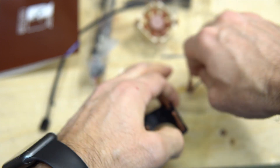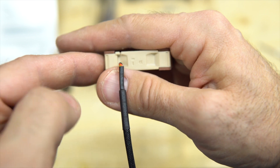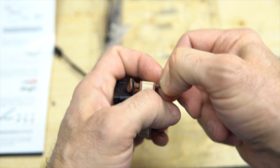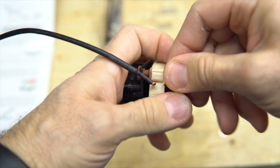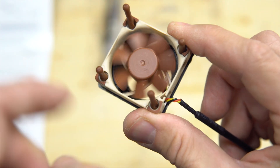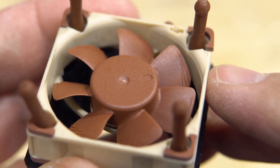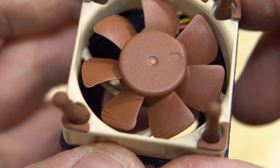You can see here it blows that way, so I want to blow air on the hot end, which means this should be oriented this way — pull and push. And if you see, this fan is on ball bearings so it turns really, really easily. It's a really well designed, high-end fan. At the end of the blades there are some lines — those prevent noise.